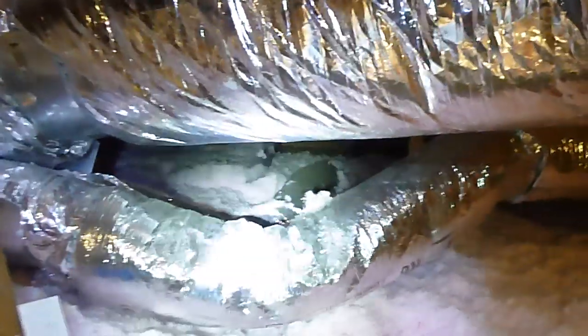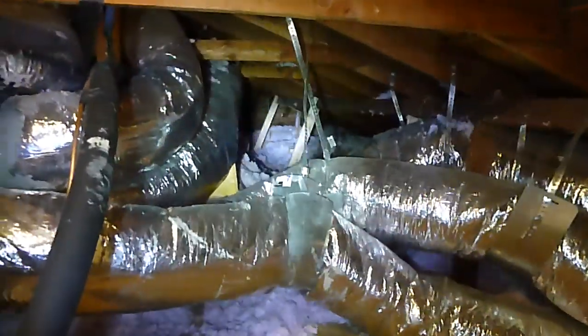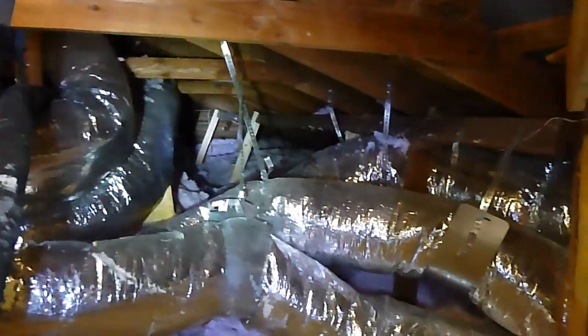Okay. The air duct should not have more than a half inch sag. It shouldn't really be on the ground like that. Okay, this insulation, they removed all the old insulation, which I'm a big fan of. So all this insulation looks like it's fresh blown. You can tell people have been squirreling and walking back through there. They've compromised it some.